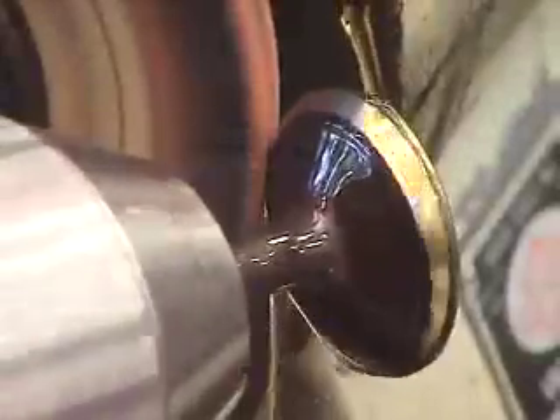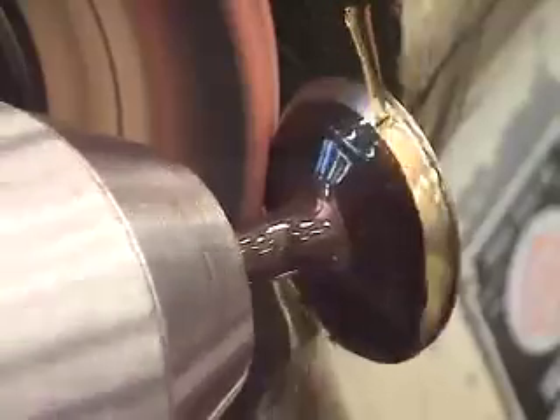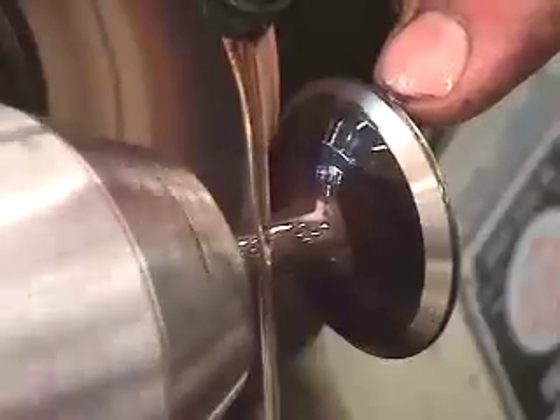Now that we've established our contact cut and zeroed our index wheel, we move the valve across the face, dialing it in as we move it. You can see I'm going to the bump stop, and you can see the definitive line showing up on the valve where it's starting to correct a slightly out-of-round or distorted surface. We're into one thou of cut now — I'm going to use the whole stone, and you can see the surface of the valve correcting itself as we move through the process.